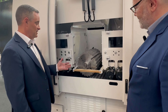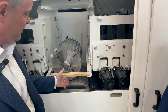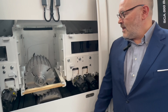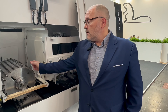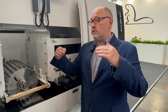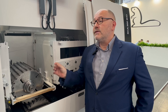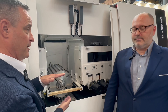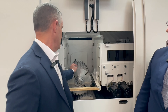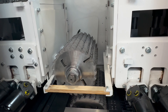Wow, Cristiano, this may be a design most people haven't seen. Most people are used to having one saw arbor, but this one has two — one on top and one on the bottom. What would be the advantage of that? The main advantages are two. The first advantage is the fact that you can reach higher thickness, up to 240 millimeters in thickness, and you can reduce the diameter of the blade by using two arbors. Because of it, the kerf of the blade when they cut is reduced, so the yield is a lot more.